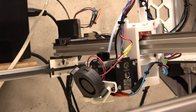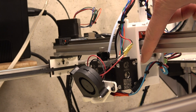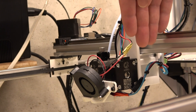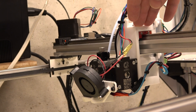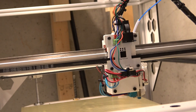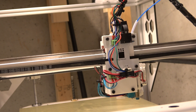Here's a look at the Hemera setup we have now. I'll show you the mount more in depth in a moment. Basically, we used to have the motor behind here underneath this rail — now we just have the Hemera parked out front. It did change the build volume a little bit; I lost a little in the front. But for the advantages the Hemera gives you, it was well worth it. I used a very simple part fan mount for the front, and it came with a little duct. From the back, I did retain that PCB that FolgerTech likes to use. It's not the best setup — some connections aren't all that tight — but it was a better alternative than running wires all the way back to the main board. With the way I designed the mount, it clears everything just fine. It's a pretty clean install all together.